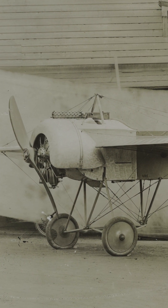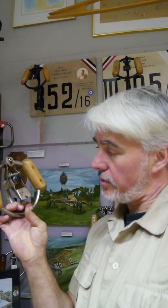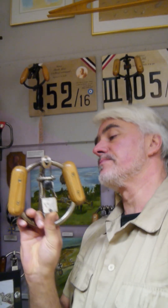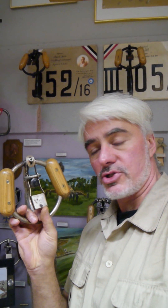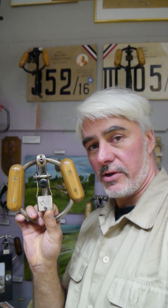The fourth grip in the development line was used in the Fokker E3. The major difference from the earlier ones is obviously the circular front scaffold tube, which was done to ease mass production. The wooden handles are now canted, making them more comfortable for longer flights. The rear tube was also reduced from formerly 18 millimeters to only 12, making the whole arrangement a bit lighter.